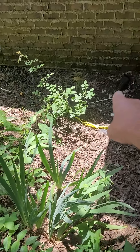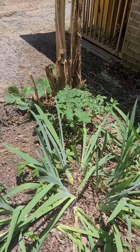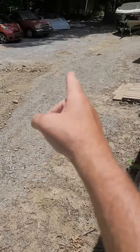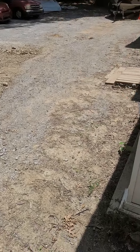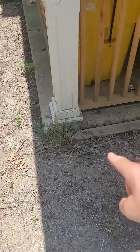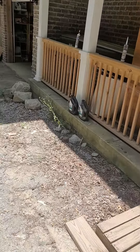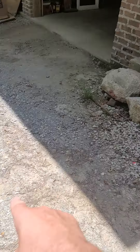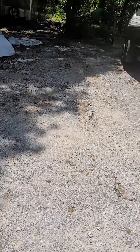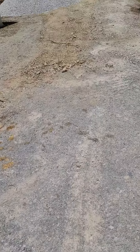Remember here, we're going to do a two by two grate. So while they're setting their pump in and getting their lines ready and we have the things pulled, I'll come back here and dig straight across this driveway all the way down there by the trailer. If it's okay with you, I'm going to pull them off the job. You can take your four inch two by two grate, pick up a downspout here, and then we'll snake it over and try to get some grade to get that thing down there. We do have a little play because we have to put at least six inches of rock in here to cover it all up.